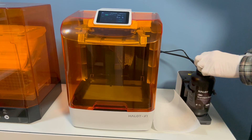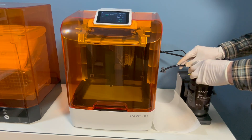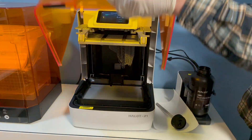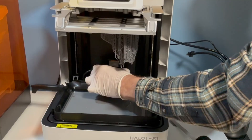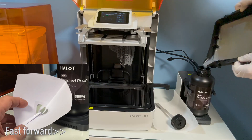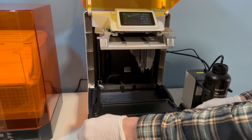Now that printing is complete I've decided to manually drain the resin rather than use the feed out system, basically because I was quite impatient to get started and have a look at the print. The vat is unclipped using the two levers on the side and then the detection unit also needs to be moved to the clip on the rear. I forgot to use one of the filters here when I was pouring the resin back into the bottle, so that's something I'll have to remember next time.